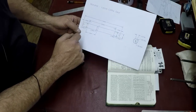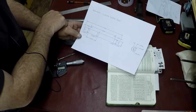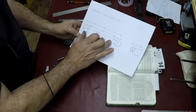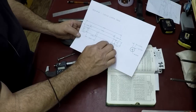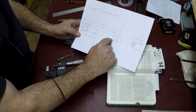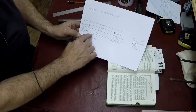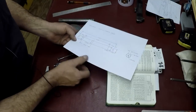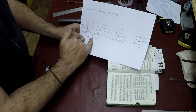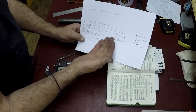I made a drawing, and this one was tapered about 4/1000ths overall, and so I made this one tapered 4/1000ths overall. So we're going to start down here at 0.788, and we want to end up up here about 792. So 0.7904 is the bore of the gear, and at this line, at 1.9 inches in, is where that dimension is. Or, you know, roughly.